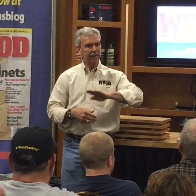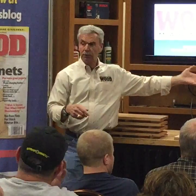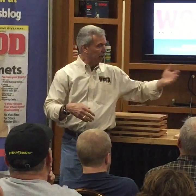If that board already had the tendency to start cupping at that length, even those shorter sections have some form of that cup, or that bow, so when you now try and join or machine them on a table saw or router, they're going to fight you.